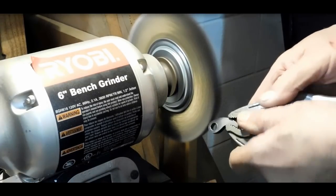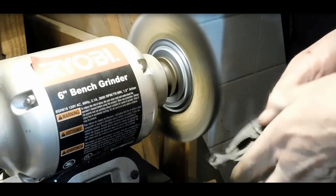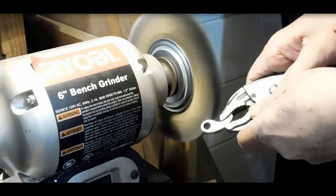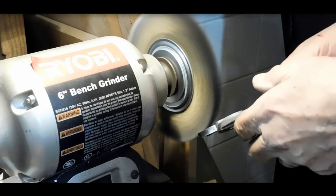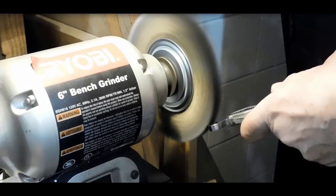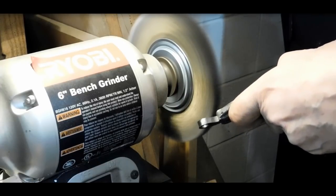And then again, once I put the machine together and I'm timing the 2 clicks to get the machine to run right, I'll be filing it down. It was made about 1/8 of an inch oversized, so filed to fit, and then it'll get case hardened, just the tip of it, and then this click will be done.